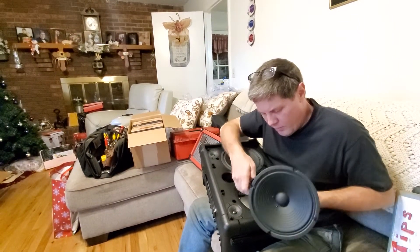Can you feel the difference in weight between the speakers? The Jensen is a lot lighter — significantly. The magnet is significantly smaller. Let's show the front and back comparison. You can see the thickness difference in the magnet. The Jensen cone also looks to have tighter ripples. Put your finger inside this speaker — feel those ripples and the distance. Now try the Roland — definitely tighter on the Jensen.